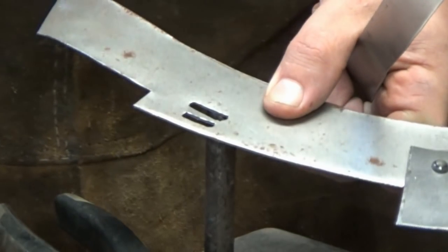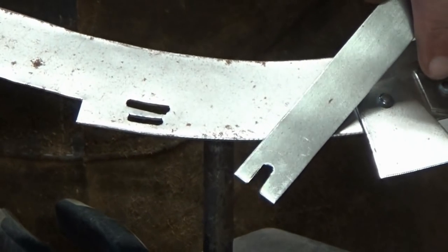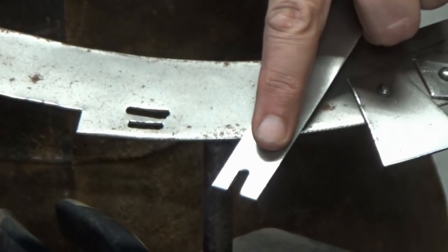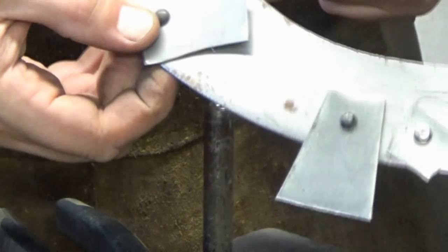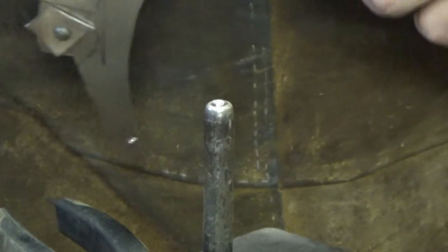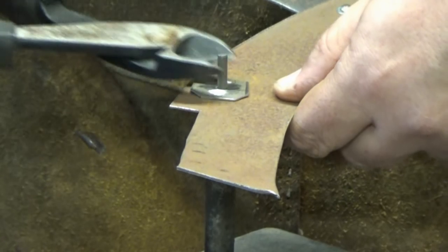So I've removed the rivet — just to show you this tool. As before, we've got our slotted piece of material, our rivet, and the other piece of material we're going to stick on it. What I've made is this slotting tool — it's just a piece of thin material, 18 or 20 gauge, something like that. I've punched a hole in the end and then just ground out the lines with a slitting disc. What you do with this is go through like normal, put the washer on the back, and then slot the tool between the two pieces of material — the child and parent piece. Put it down, make sure it's all compressed, come off just a touch, give it a snap.